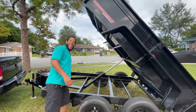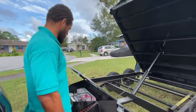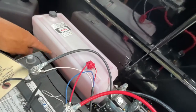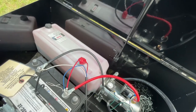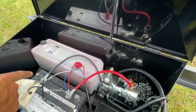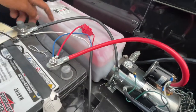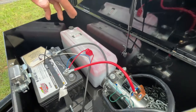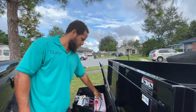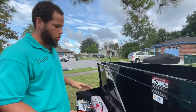Check this out — I didn't know this, but I could kind of tell from the color of the fluid. This hydraulic fluid in here is actually low right now, see the fill line? Watch as I put the bed down — all that fluid is coming back to the reservoir. The tip he gave me is you never want to fill it with the bed up, because all that fluid will be in the hydraulic cylinder and when it comes down it'll blow. And this is actually automatic transmission fluid — you can tell because it's red.